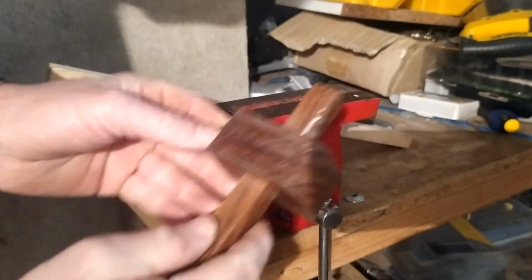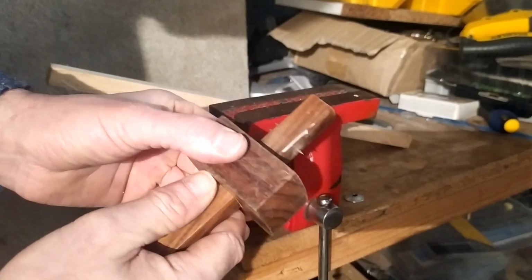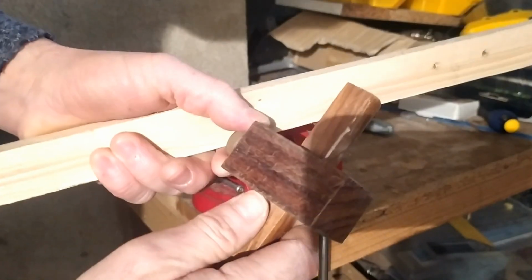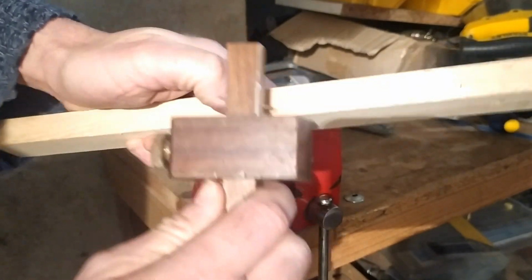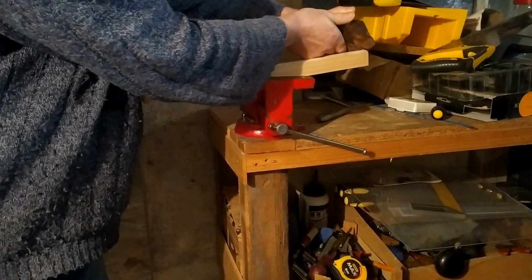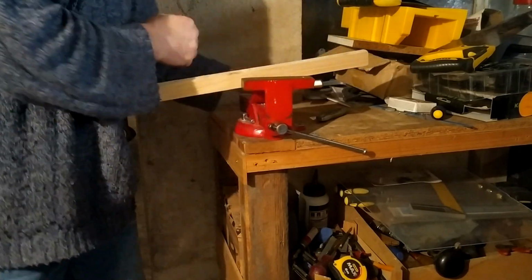And the solution I came up with was actually, well, it was quite easy after a little bit of thought. I had everything I needed here in the basement. The first thing I used was a mortise gauge. Now, a mortise gauge is a tool that carpenters use in order to cut a placement for a lock in a door, for example. What I did was I set my mortise gauge so that I could find the exact center point of the 19mm MDF. And once I had done that, I traced a nice little line right down the middle, so I knew where I had to cut my mark.